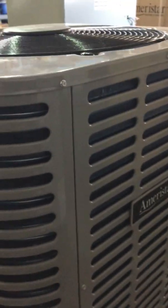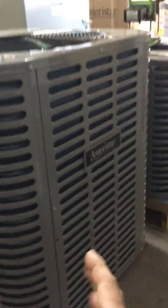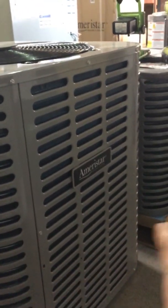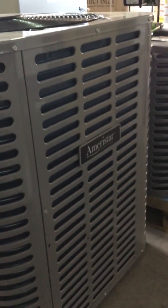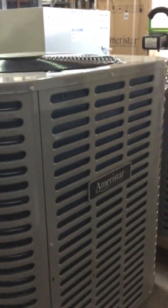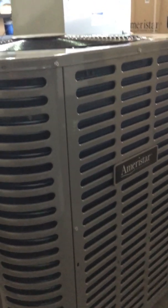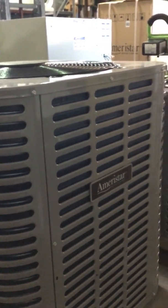Another important aspect: a lot of air conditioners and heat pumps have an outside housing there to protect the coil behind it. A lot of brands out there don't have much of a guard at all around that. So kids with a ball, or if you bump into it with a lawn mower — even a light bump — if it hits that finned area of the coil, those fins can get damaged real easily. That's one of the things I think makes this a very good quality unit for a budget-priced item. And then on the indoor coil, one of the things I've noticed with it —